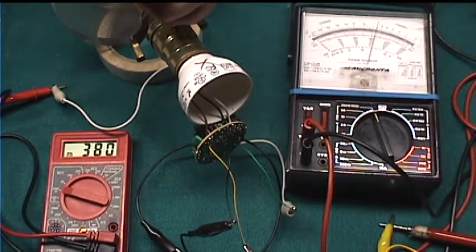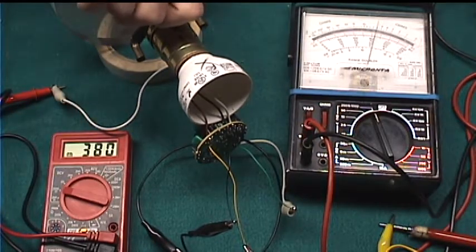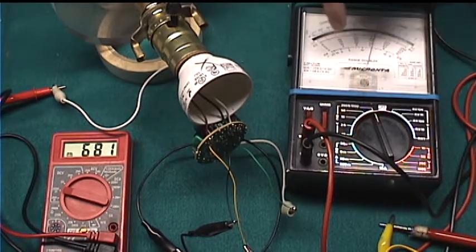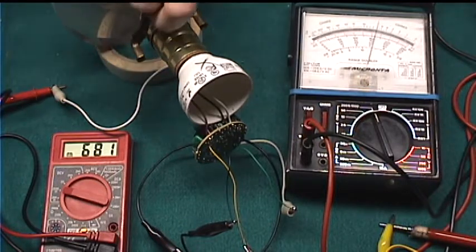Now, I'll switch this from medium to high. Should see high voltage on the base. 0.68 volts. That should be enough to turn on the transistor, and it would activate the relay, except there's no current flowing, so that supply isn't active.